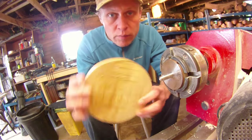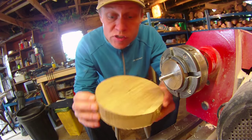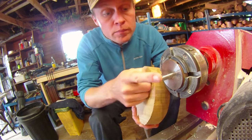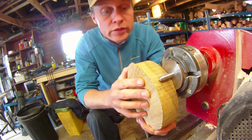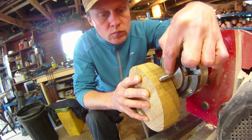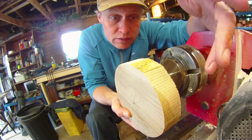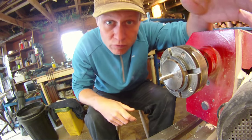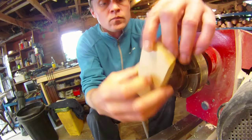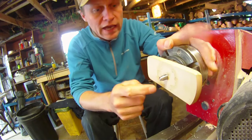So today I'm going to turn this little piece of American oak and finish it with my new Hampshire Sheen wax. But it's quite thin — it's only about an inch and a half. And I'm going to turn it on a worm screw. But as you can see, when I put the blank up to the actual screw itself, it doesn't leave me much room to play at the bottom for a recess to put in the bottom for when I reverse it in the chuck. So I'm going to use a couple of pieces of sycamore, which work out to be about half an inch, and I'll screw those onto the worm screw first to act as a spacer.